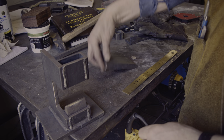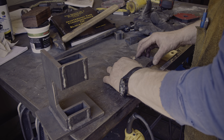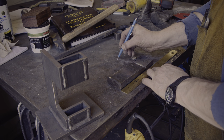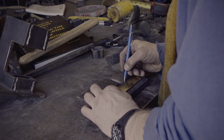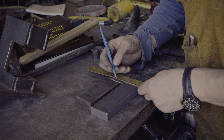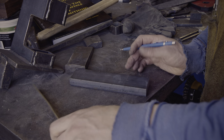In this case I want to make split dies. Half of the dies are to forge in a chisel shape and the other half will be completely flat. You will see later in the short demo why I need this. I am using mild steel bar which is three-quarter inch thick and two and a half inches wide. The total length counting both dies is about seven and a half inches. The bottom die is two and a half inches long and the top die is five inches long.